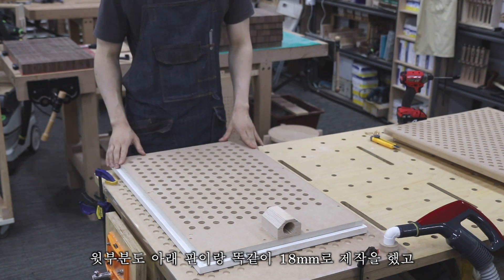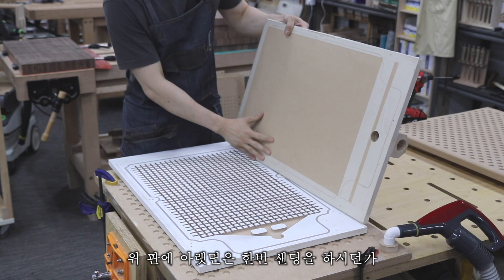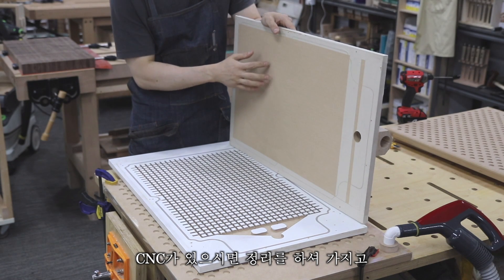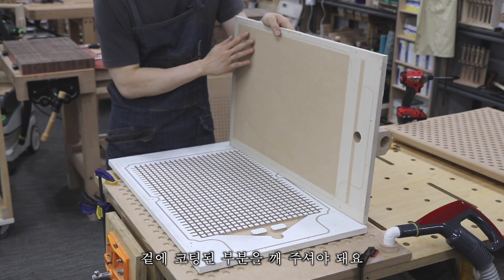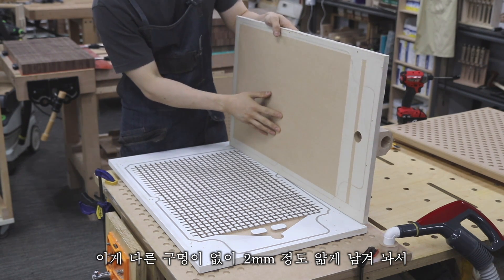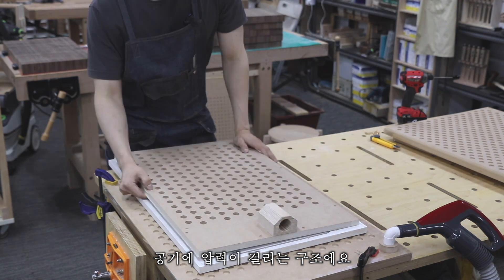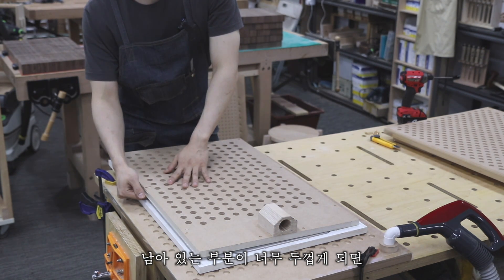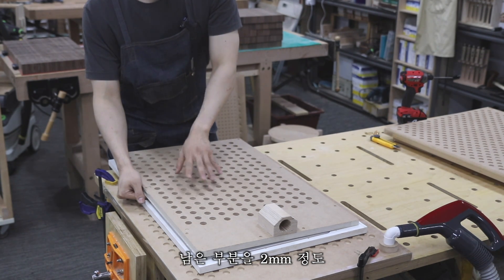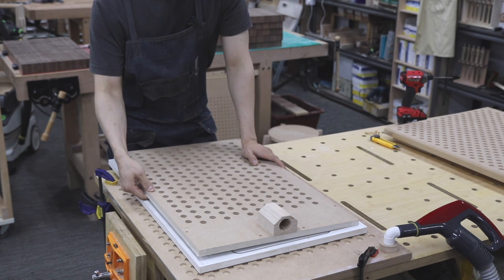The top plate is also 18mm, same as the bottom. An important step when making the top plate is to sand or CNC-surface the underside to break through the factory coating. This allows air to pass through the MDF fibers. The remaining MDF thickness is kept to about 2mm so air pressure builds up through it. If this remaining thickness is too large, the suction pressure drops — anything over 2mm showed noticeably weaker performance. The ideal range is 2mm down to under 1.5mm.